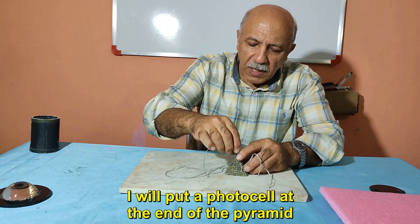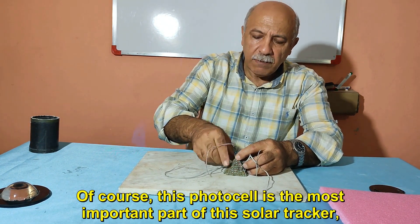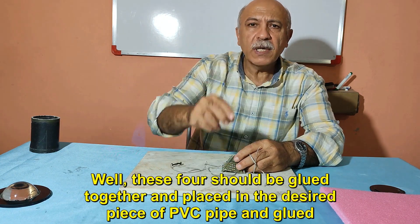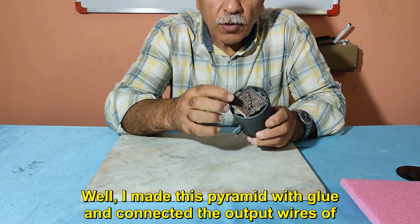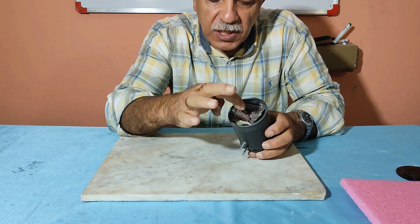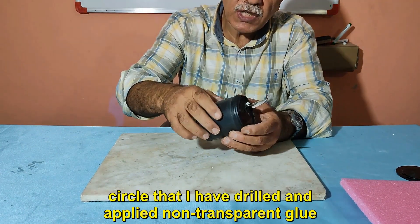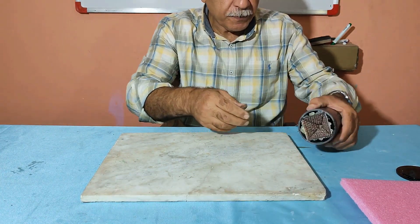I will put a single photocell at the top of the pyramid. This photocell is the most important part of this solar tracker: when the sunlight is perpendicular to our solar dish, the focus of the lens is placed exactly on this photocell. These four triangle faces should be glued together, placed in the desired PVC pipe, and glued. I made this pyramid with glue, connected the output wires of each face separately to the flat cable, and mounted it in the cylinder. Our pyramid now has four faces and a photocell at the top. I passed the flat communication cable through a light-blocking plastic circle with non-transparent glue, and installed a base with two screws to keep the tracker on the system.